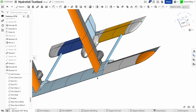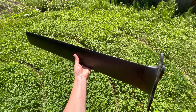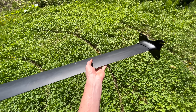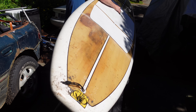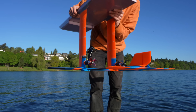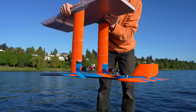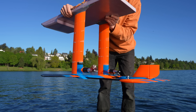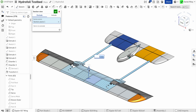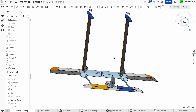Another thing that makes my design unique is that it has two motors and two masts. I chose to use two because I'm using regular e-foil masts on the full-scale version, but mine is going to be much larger and heavier, spaced around an 11-foot stand-up paddleboard, so I needed to double up on the masts and motors. Having two motors also allows me to do differential thrust for yaw control, which might let me get away without a rudder. By the way, OnShape is a cloud-based CAD program — click the OnShape link in the description to check out or download this design.